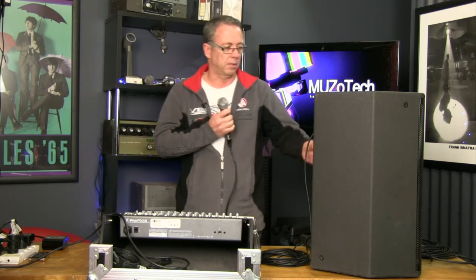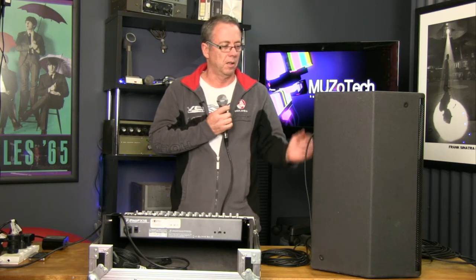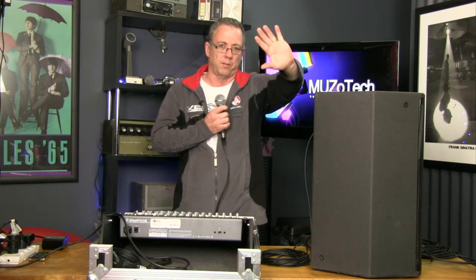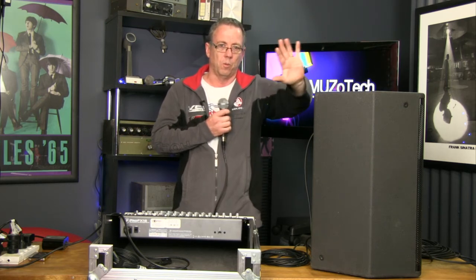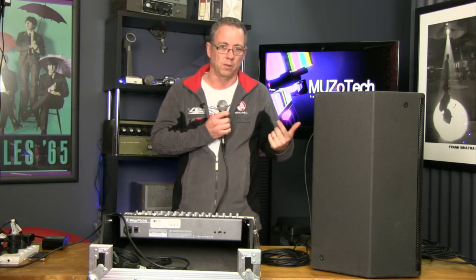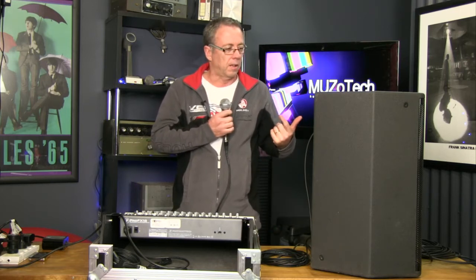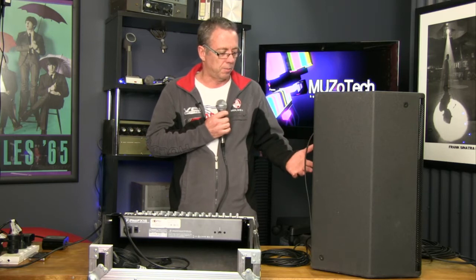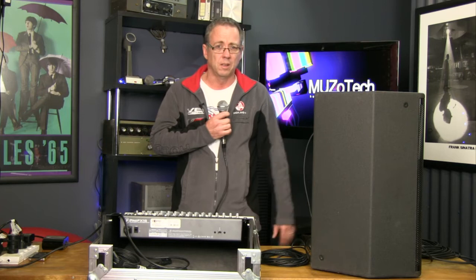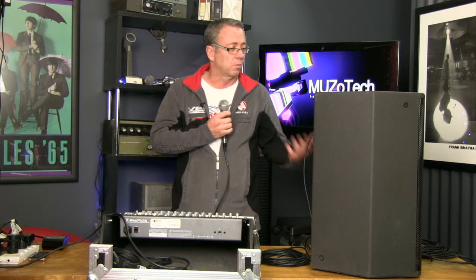So always make sure your speakers are in front of you, or facing away from you — other than foldback monitors, which have to face you but they're facing the back of the microphone. These sort of mics pick up from this direction, so make sure your sound from your speakers is going out that way and not with the mic facing into the speakers. If you always remember that — if you have a couple of speakers on stands for a vocal PA, make sure they're out in front of where you are — you'll get a lot more volume and gain before you get that squealy noise.